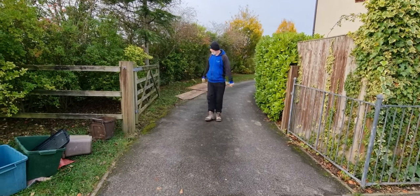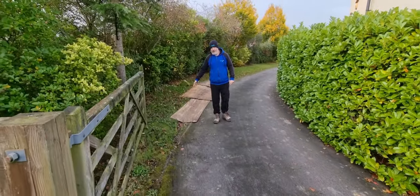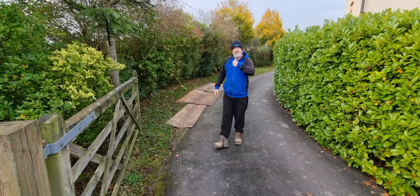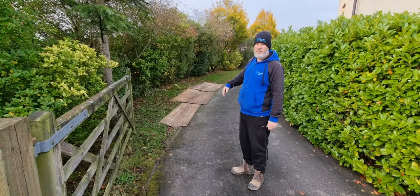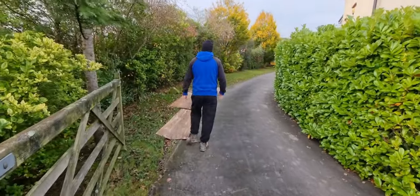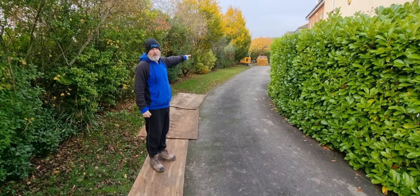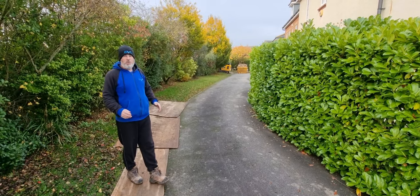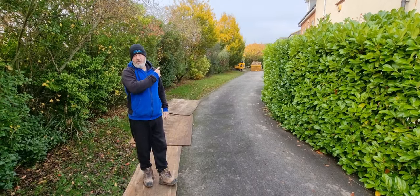But if you come closer into here now, the big lorry came with a skip on it, got to here and said, can't do it, turn all the grass up. So the residents here, they actually gave permission to turn the grass up. Well, he didn't want to do it, we didn't want to do it. We put these boards down, so if you come this way, what we have to do is get a smaller skip wagon with two midi skips that we've got up there. Can you see that up there, Brad, in the distance, the two midi skips? Aye. And then we've got a smaller wagon again to deliver the 8 ton of scalpins, or MOT type 1, that you've just seen.